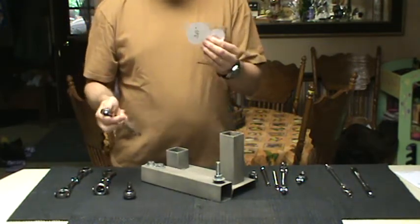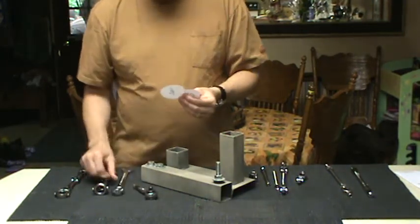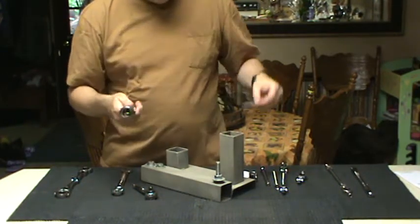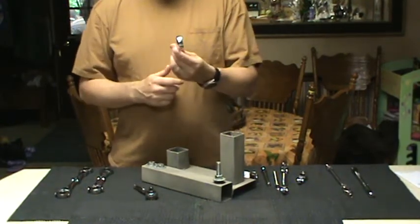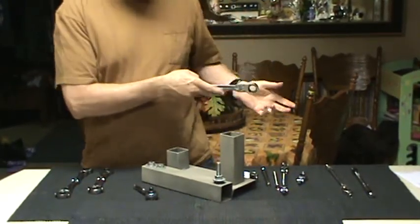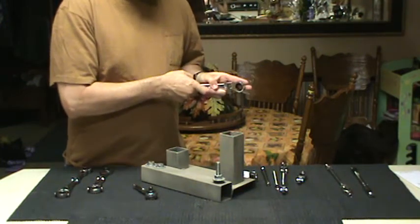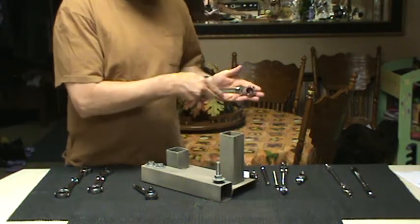And when you're a mechanic and you're using tools in a tight situation, you rarely have that much room to use a wrench. The wrench I designed uses, as you can see, a much smaller space for the head clearance. It fits in a very tight area. That's one reason I invented it, and another reason is the ratcheting part of this wrench works very well, except for when you use the handle to pry things loose or tighten them up. It works great when it's straight, but as soon as you use the flex on the flex wrench, it takes your force that's with the handle, and it's a twisting action against the head.